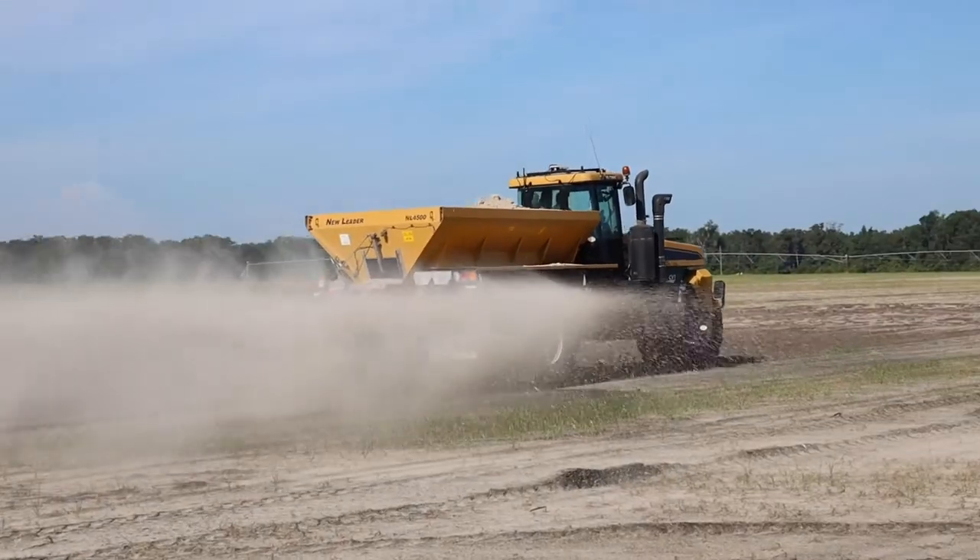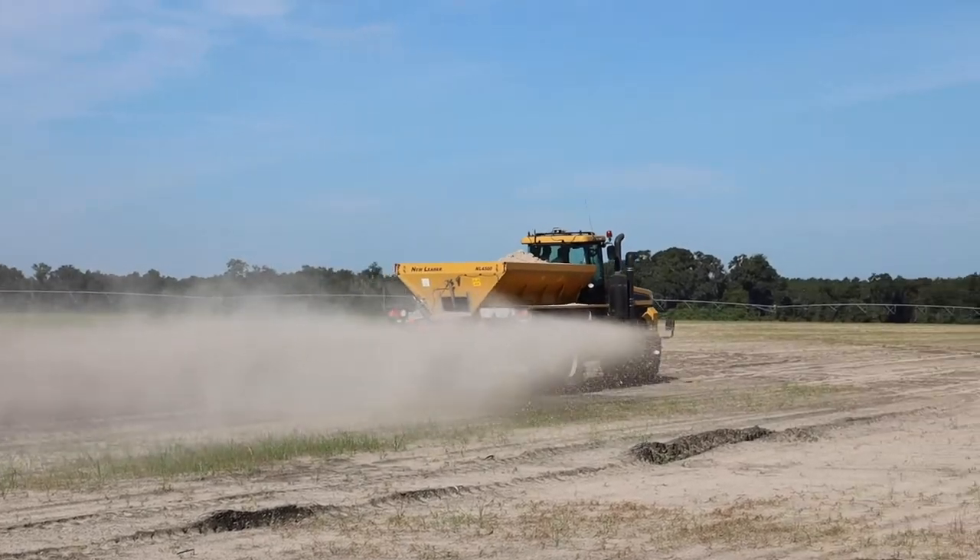On most systems we want to be between 1650 and 1700 RPMs, and then when we get to that hill the engine will automatically ramp up to give us the power we need. Let's take a look in the AccuTerminal at where we set the minimum.